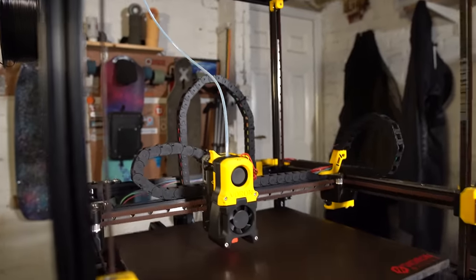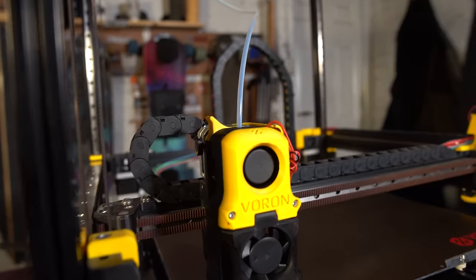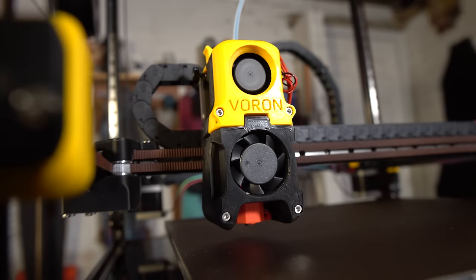These need to be swapped for 8mm because there's just movement on this nozzle, which is unacceptable. I don't know how I didn't find that initially. The bad news is I have stripped two of these when I was trying to tighten them up because I didn't realize they were too long. And they're only small, they're M2.5, so they're tiny. Two of them will come out. I've ordered an easy out kit. I ordered it on Amazon next day. So I ordered that yesterday, that should be coming today.